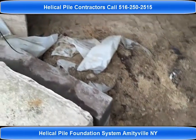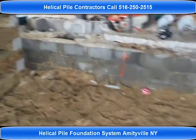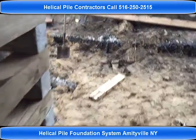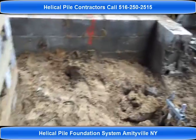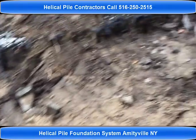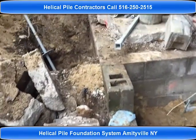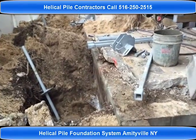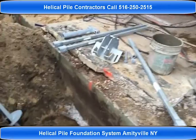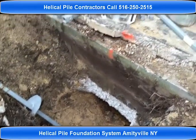Here's another one — not too much room in between the cribbing, three or four feet, to get our machine in here and try to do our thing. For this existing foundation, we have to drill rebar, epoxy, and then set our new foundation on top of it. We began here, prepared the footings already — chopped it nice and clean to accept our brackets.